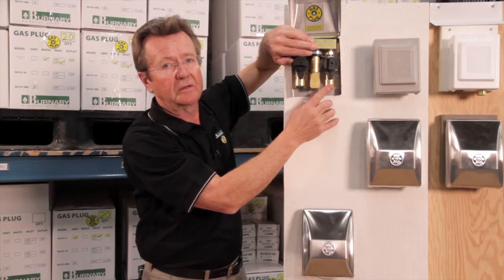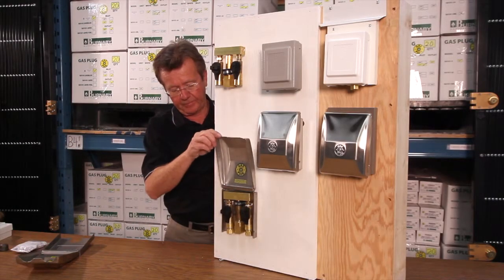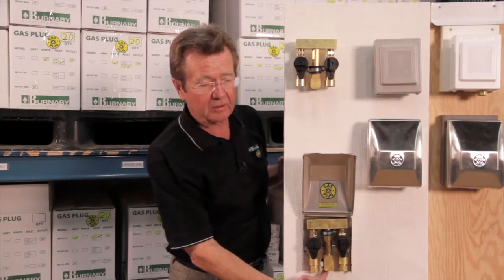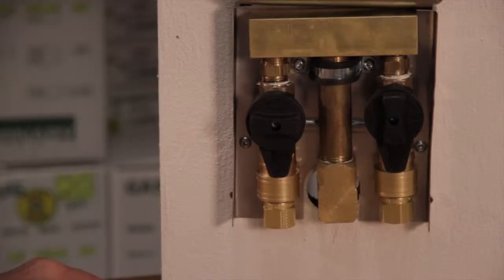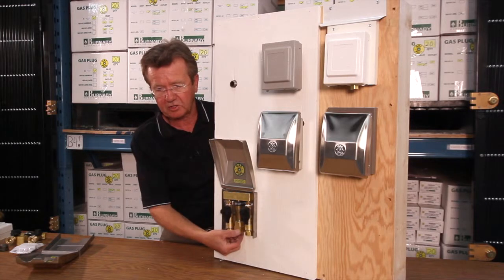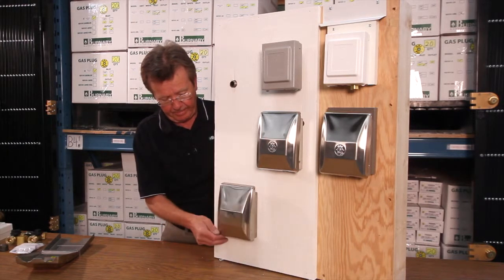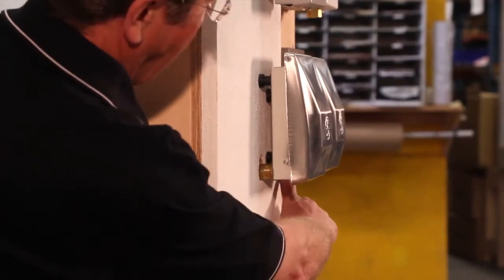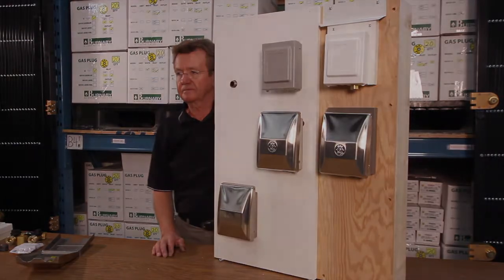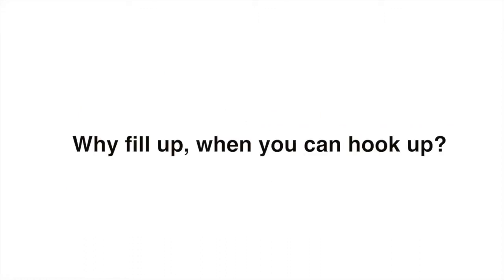Remember: don't leave your plugs in the couplings when you're done. Now I'll take you down to this installed unit. You can see the hole is bigger on this one than on the other units shown in other videos, because the throat of that elbow needs to go flush into the wall. Then you do your caulking right around that elbow to seal the unit. We also have one mounted with standoffs in case you need to bring it out from the wall, and one with a backing plate for siding installations. We'll see you next time.